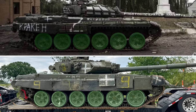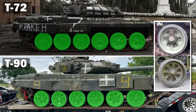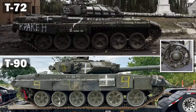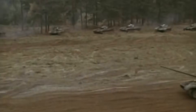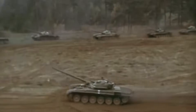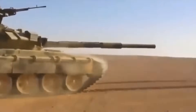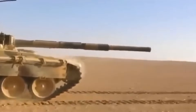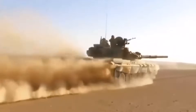If the tank has six larger wheels, evenly spaced with almost no gap, it's a T-72 or a T-90. The wheels will have external rubber, and either six or eight spoked indentations, with a bolt in the middle of each, surrounding a central hub. The idler wheels are again different — smaller, with five large, thick spokes. The T-72 was initially developed as a cheaper, simpler T-64 to support mechanised divisions, but has since evolved into an arguably superior vehicle. The T-90 was essentially a modernisation of the T-72, with an almost identical hull, so the road wheels and suspension systems are interchangeable, and we'll need to use other tricks to tell them apart.